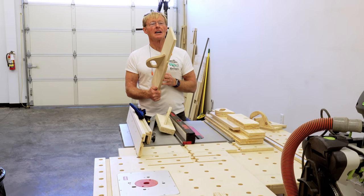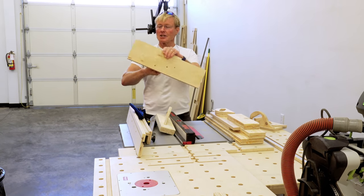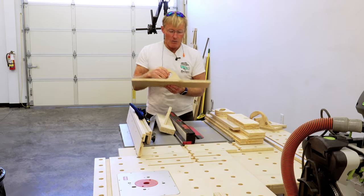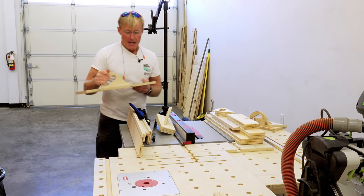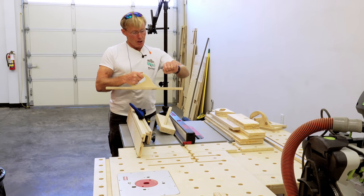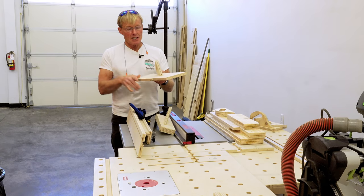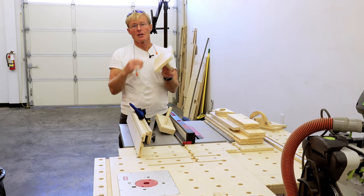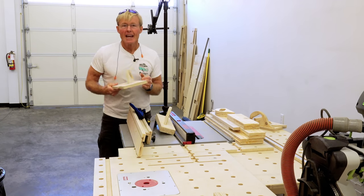I did make one push block recently, a couple of months ago, primarily for the router table. It's just a single piece of three-quarter inch with a little notch in it, and I put the same handle on it — just to push it up against the router table fence when pushing narrow material through. It pushes down, keeps it tight, and motivates the material from the back. I just made a rectangle piece, notched it out, took one of my handles, put glue on first, and screwed it on. After it got good and dry, I removed the screws because I don't want any metal in any of my push blocks.